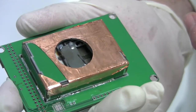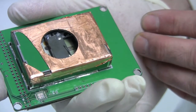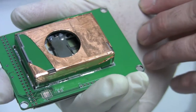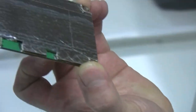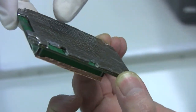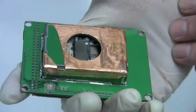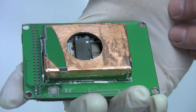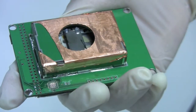Underneath that is really the readout board, and underneath that is an electronics support board. The whole thing is encased in a shield of lead, tin, and copper. On the back is actually one of the sandwiches of lead on the outside, tin and copper on the inside. The entire thing goes into an aluminum box that also has the sandwich of lead, tin, and copper within it to protect the array from extraneous sources.